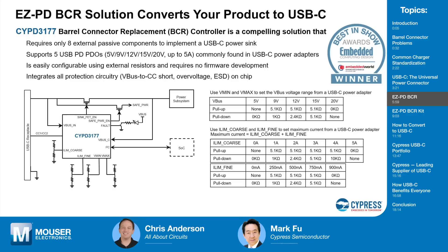Everything is done on-chip; no firmware development is required. The customer can simply put the chip on a board with a very simple hardware design on a PCB and it works. As simple as it is, it's also very sophisticated because it integrates all the protection circuitry required on the Type-C port — for example, VBUS to CC short protection. VBUS is no longer just 5 volts; it can now be anything between 5V and 20V, so the communication channel right next to it may be subject to a brief short condition due to ungraceful unplugging or wear and tear. Over-voltage protection and ESD protection on all digital pins are also built in.